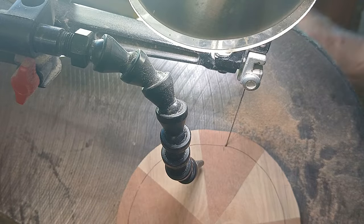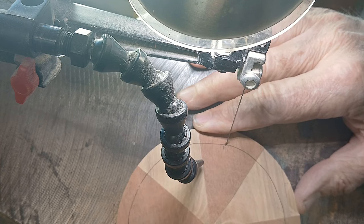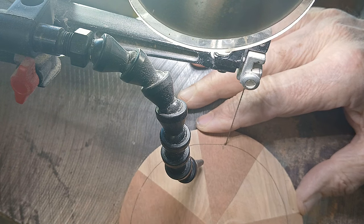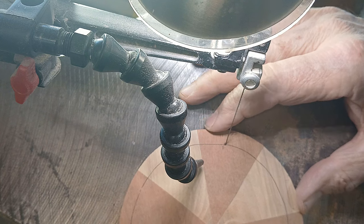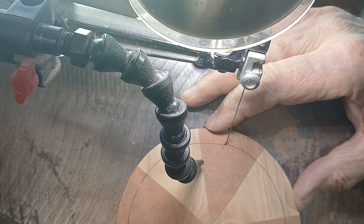Here we go with the same procedure. I used that ring to lay on there and mark the inner cut for this ring. So I'm going to cut this. It's all at the same angle, 38 degrees. And double check, but I think that's it, three rings. And we'll start seeing about mashing them up here in a minute when I get this cut off.